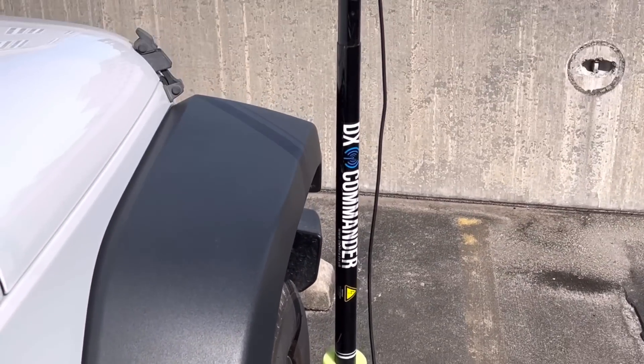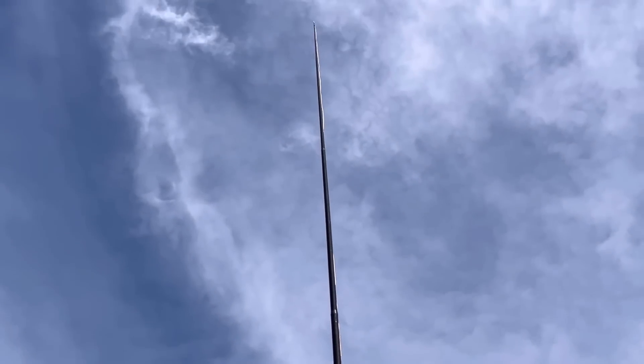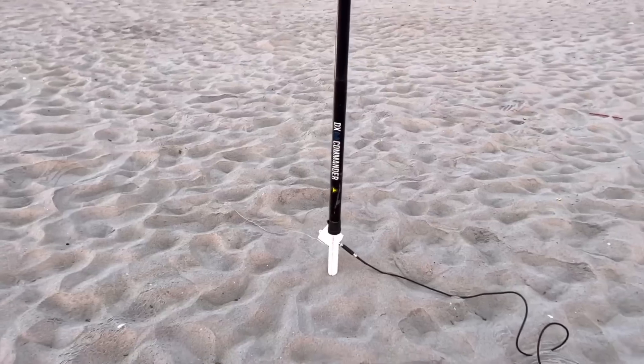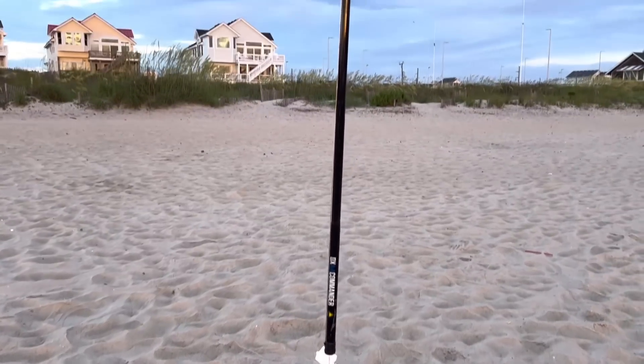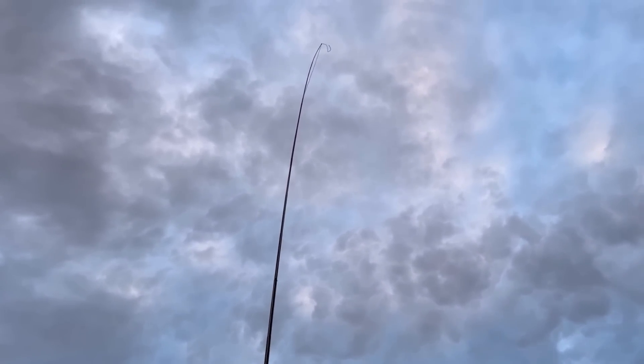To say this has been a good day might be a little bit of an understatement. I just talked to Africa with a wire — a piece of speaker wire — sitting on top of a parking garage in the middle of downtown, surrounded by buildings. Pretty cool. That's it with a half-wave. Half-wave verticals are amazing. I've made some amazing contacts with a simple half-wave vertical, a 20-meter half-wave vertical that I normally build. I've talked QRP sitting on the beach to Australia, all the time. To do it here today was pretty cool. What I wanted to show was really just dispel the whole no-radial thing that manufacturers throw out there.